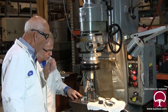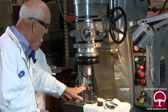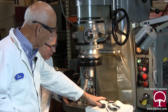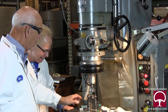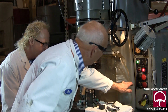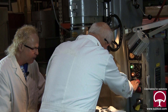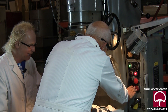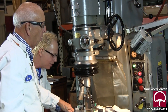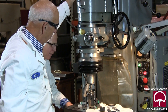I came in here with the part in place. Before I came into the part, I moved the table over so it was clear of the part and I set my stops — I don't want to come in and crash into the part. So I set the stops up off the part, brought it into position, then hovered above the part. Then I turned on the oscillation — I had the spindle in the off position — and came in to make sure I didn't touch the part at all, gradually feeding in until I touched it.